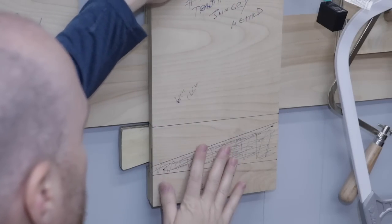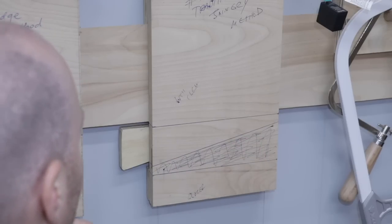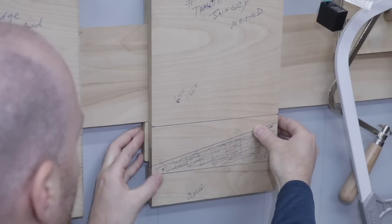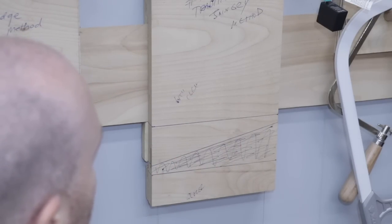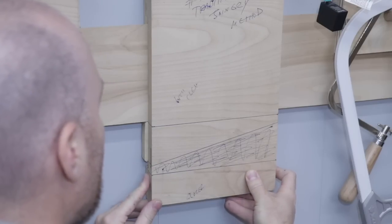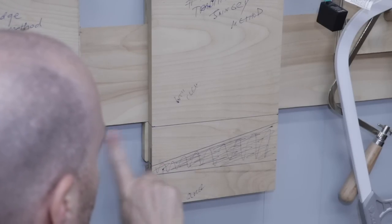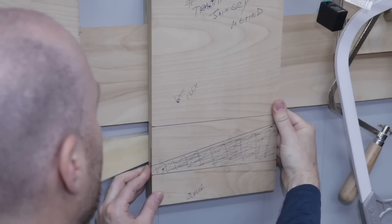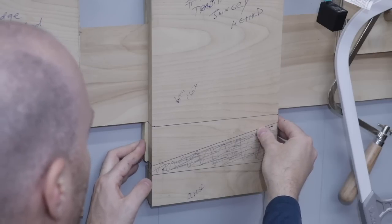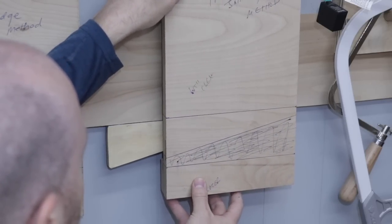Let's take a closer look at this method. It's hanging on the wall — we have our angled spacer already mounted to the tool holder, and then we have our wedge. We simply push the wedge in and it immediately tightens up the tool holder to the wall cleat — it is rock solid. It is not going to come off this wall no matter how hard I pull at it. To remove it, you just push from the other side and pop out the wedge — it inserts this way, pops out that way, and then it simply comes right off the wall.